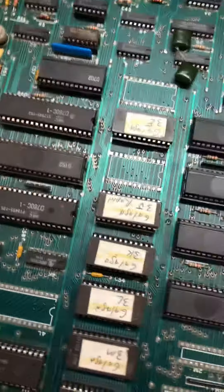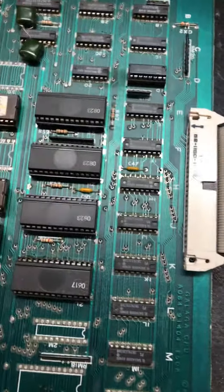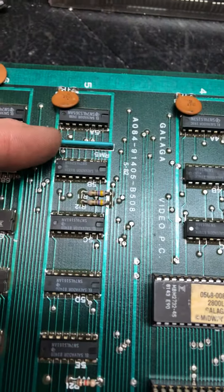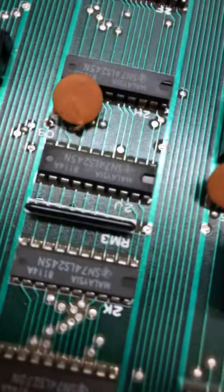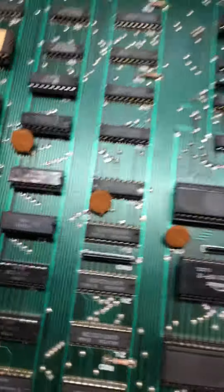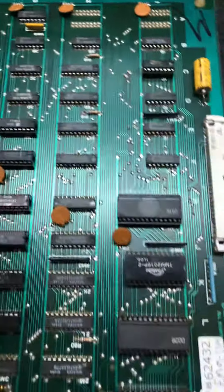All the single-wipe sockets got replaced — that was all of these, and a few others got replaced as well. On the video board, that was the only unencapsulated resistor pack from the factory; the rest got changed — that one, this one, that one, that one, that one, and that one. Then all the large sockets on this side — these sockets here and these sockets here — all got replaced. After all that was replaced, the game booted but had a RAM failure.